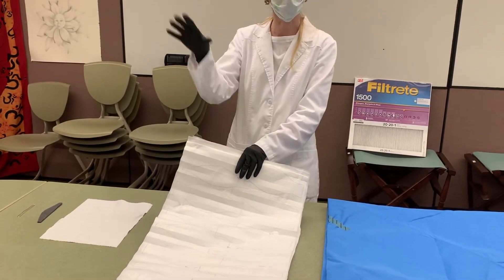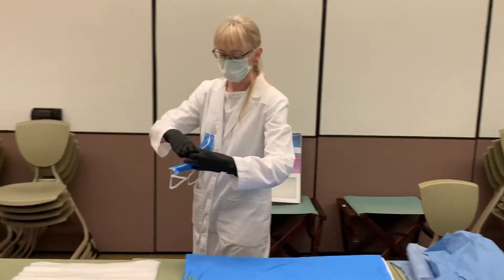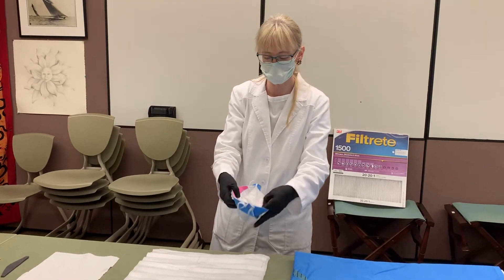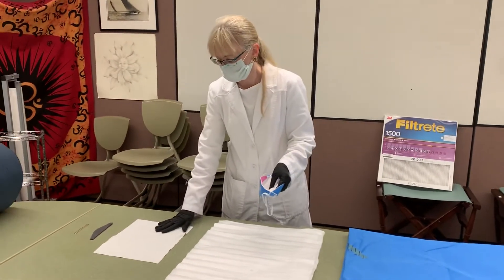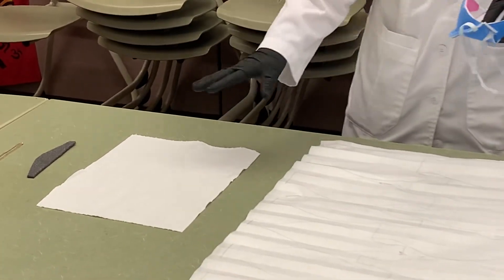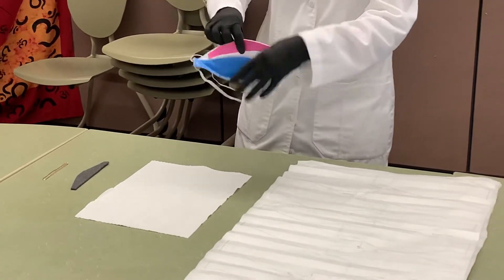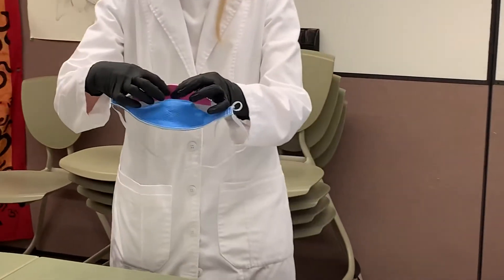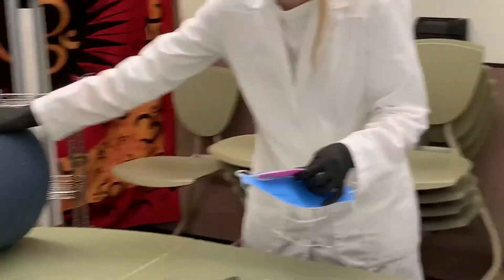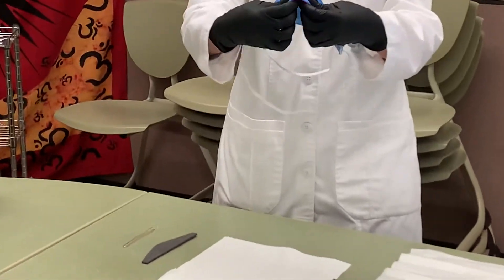Our interior layer is a 3M 1500 filter that filters out bacteria, viruses, and so forth — and we'll show you that in our filter room. That's two layers of filter in between. On the very inside is a non-woven material, what they call a paper rag. For the nose piece you can use flat foam or foam from this big roll here, and there's a piece of wire in between to help it bend. When it's all done, it opens up like this.